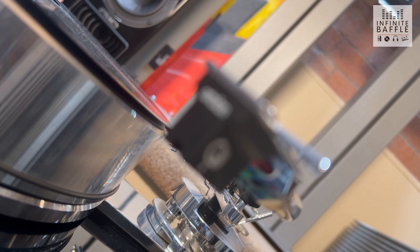To kick things off we're going to be looking at moving magnet versus moving coil cartridges. In a nutshell, moving coil is always going to offer you superior sound — better tracking, better detail retrieval, higher quality materials overall. But the big positive of moving magnet is the replaceable stylus, something you often don't get with moving coils. If you want to upgrade your stylus without changing the whole cartridge, that's an option with many moving magnets, whereas with a moving coil you'll have to replace the entire cartridge when the diamond wears out.